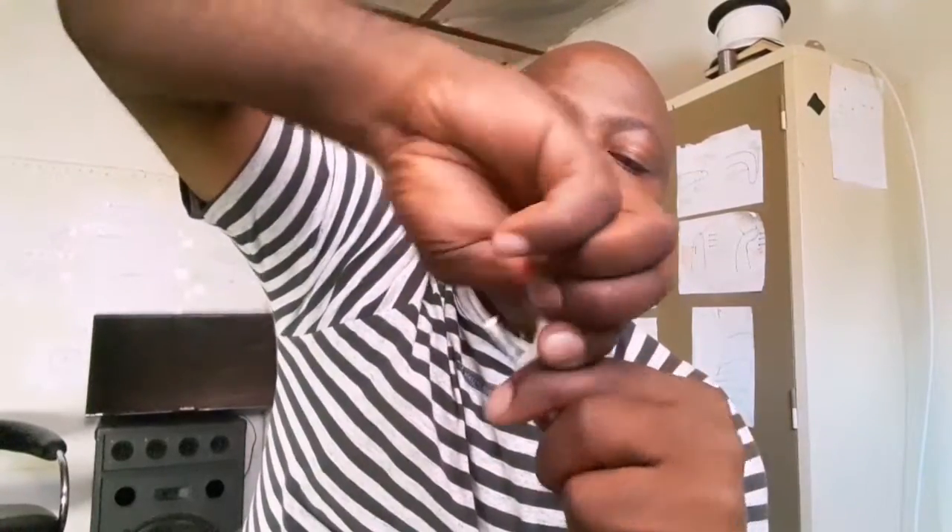We're going to use the cutter on the coaxial cable. I'm going to cut it a little bit down — maybe like two centimeters — and be careful not to cut your finger. I cut it round as well, just lightly, because I have to take the white insulation off the cable.